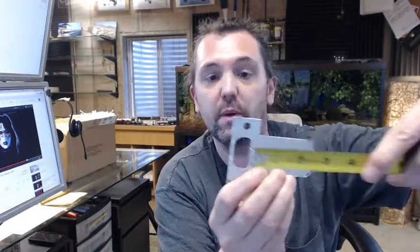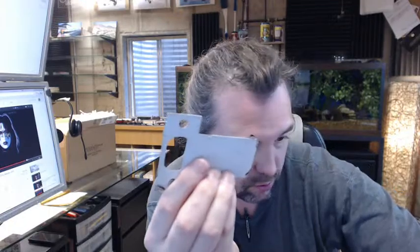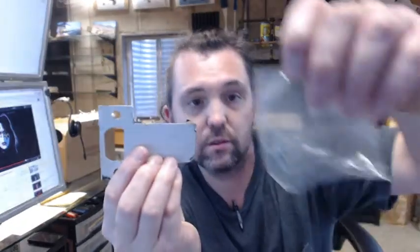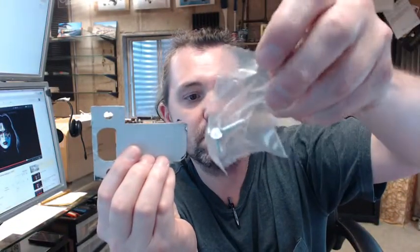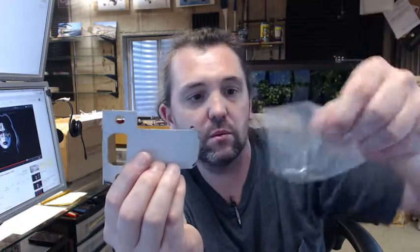How extended lip strikes are measured is from the center of the screw hole to the edge of the lip — you can see that we are at 3 inches there. It includes 2 screws. Those are not stainless, which would be fairly typical — combination wood machine thread depending on what you are going into — 8-32, typical size.